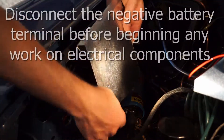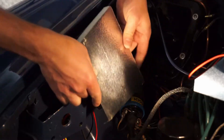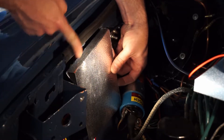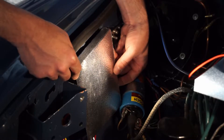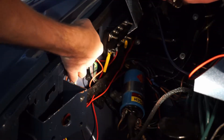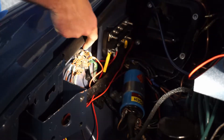Slowly but surely I'm fitting this piece. Here's what it looks like now. I bent this one on an angle so it would fit right underneath this lip here, but I've got to notch out these two sides. I'll notch that out and then it'll slide under there. I'll also have to notch out for this bolt right here, and I'll measure that after I notch out these sides.